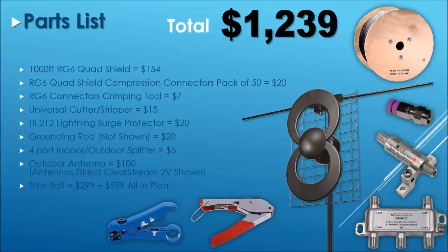And obviously, with that said, you're going to need to get a grounding rod. Now, I didn't show it in here, but you can go to your hardware store and pick one of those up for about 20 bucks or so. They're not terribly expensive. Next thing that's quite important is we're going to need a splitter of some kind. Now, I got a four-way splitter because it suited my needs perfectly fine, as you saw, and got the cables and signal where it needed to go. You can obviously get more termination points, but keep in mind the more termination points you have and the more times you split a cable, the lower the signal strength will get.